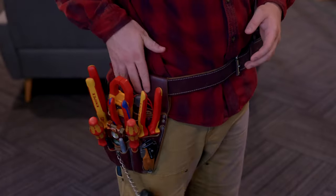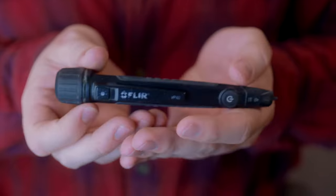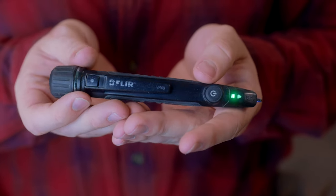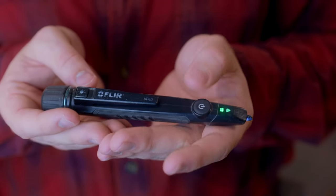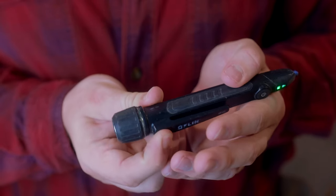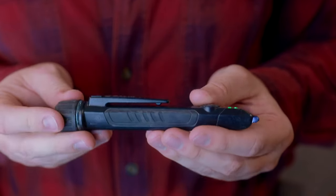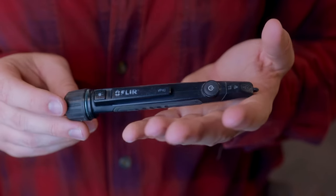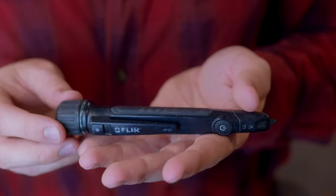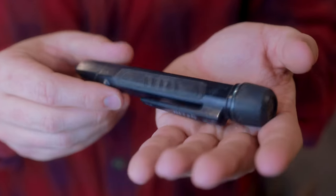On the inside here there are some more pouches. I keep this FLIR voltage detector — I'm a fan of it, it does AC and DC. It's been the most accurate voltage detector I've used. When it's green it's AC, when it's orange it's DC. It's also got a flashlight on this end, which I like to use in case my headlamp ever dies. And when you turn the flashlight off, if the voltage detector was on it'll turn back on. It's been super reliable and rugged. Just a cool way to add more uses.